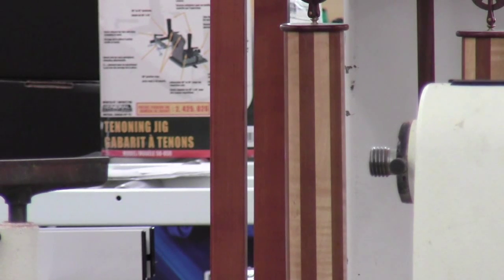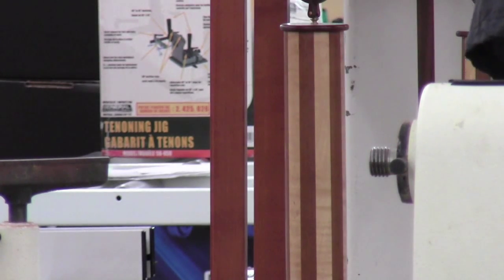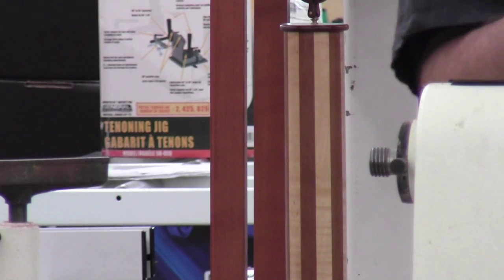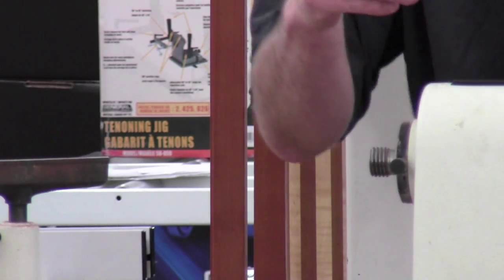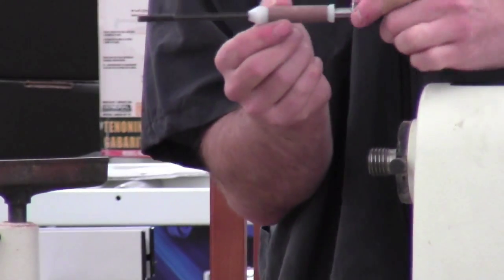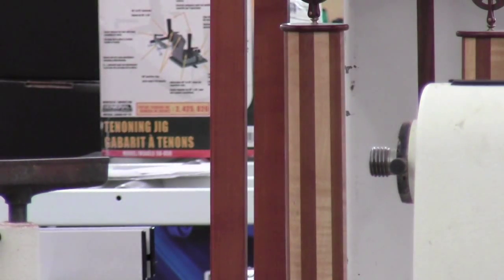They look like these. One of the problems with CAing that you can encounter is that with the bushings on there, your project can tend to stick to the bushing. Well, that is not a problem as you sand and polish it, 9 times out of 10 you can take care of that. But if your CA is too thick on the bushing, when you crack that bushing off, you will actually chip the edge of your wood blank right off, and you'll have little chip marks. So we don't like that. That's not good.